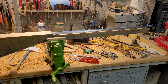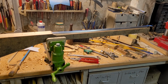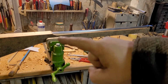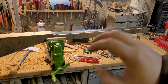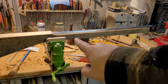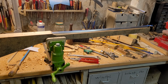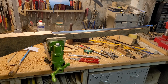somewhere like. And one really neat thing is that I get the whole barrel about 1.5 millimeter deeper, so I get level in this area with the top of the barrel to the top of the gun stock. It would not be bad to have 1 or 2 millimeters more, but then I have to level out the sides here as well, so that I'm pretty much at half of the barrel or a little bit lower. So that's all for today.